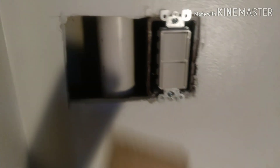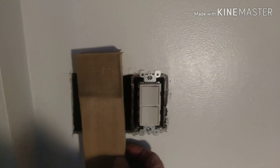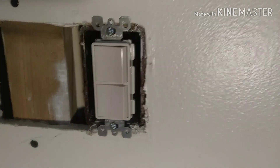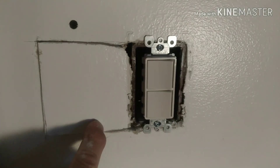All I got to do is put this piece in behind the drywall — just a chunk of three-quarter wood to screw the piece of drywall that I took off onto — and then I'll just have to mud those couple of patches and we'll be done.